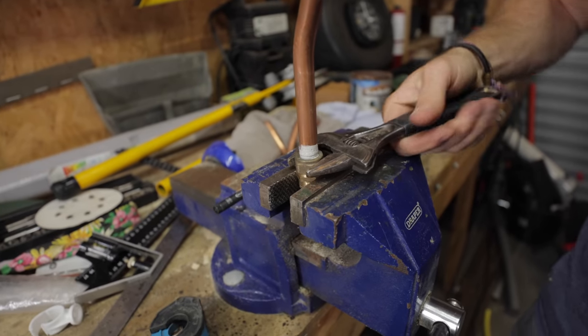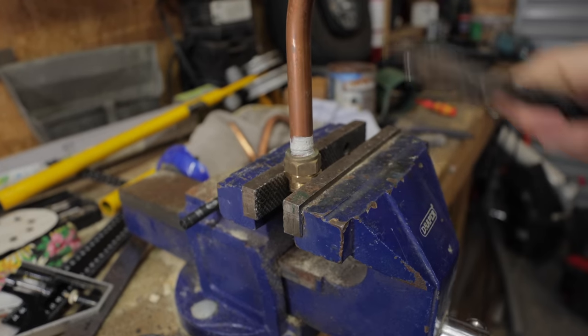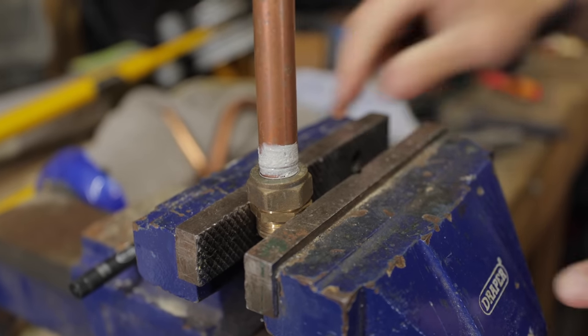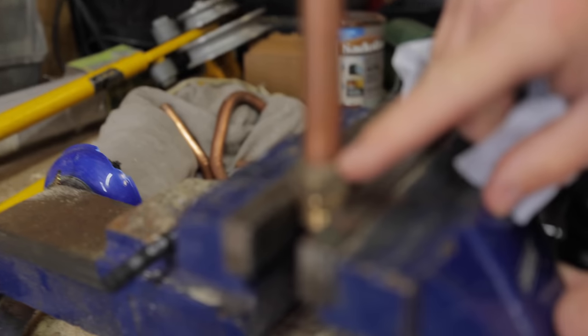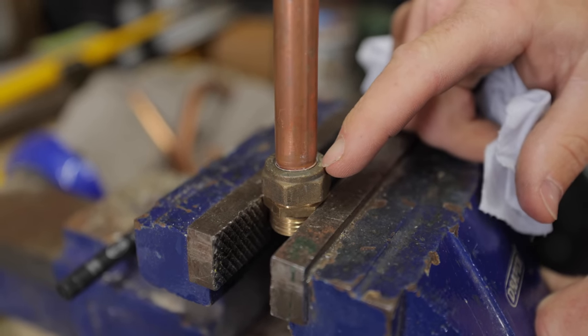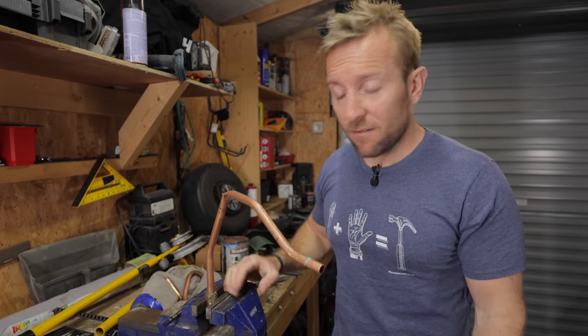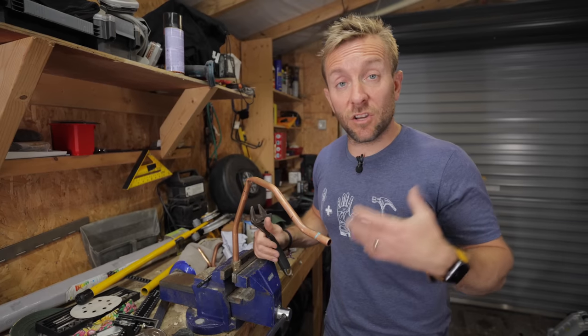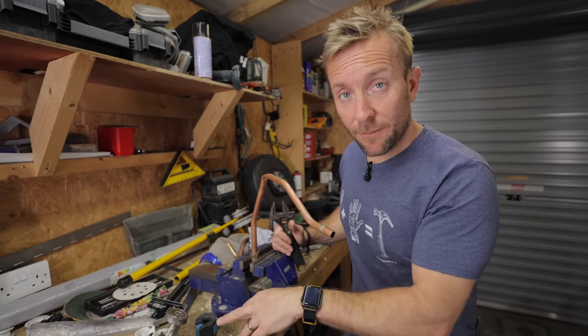If you keep tightening one of these up, after a while you'll see something happening that you don't want to see. Often what happens is it pulls the pipe out of level in the joint, and you'll see the olive starting to appear at the back of the nut. It is more likely to leak if you do this, and you're effectively heading down a path where you won't be able to replace the olive, or you'll end up with no thread left and have to cut the pipe and redo the pipework. So don't over-tighten the joint. If you've got a leaking fitting, your best option is to strip the fitting down and either do something to the olive, use jointing compound, or use some PTFE tape, which I'm going to show you in a minute.